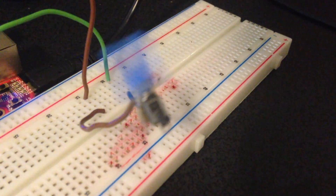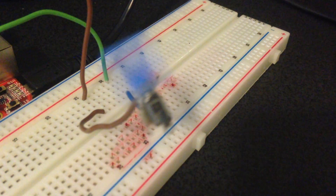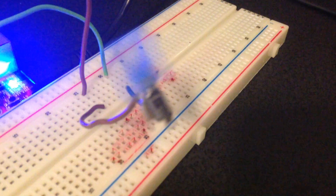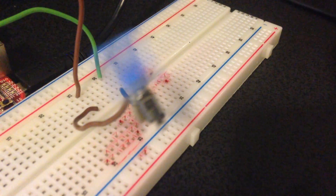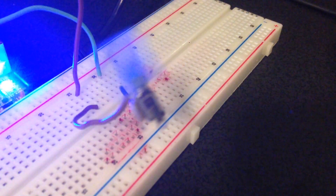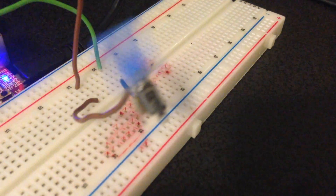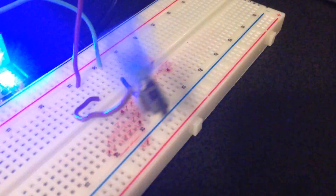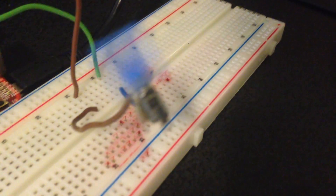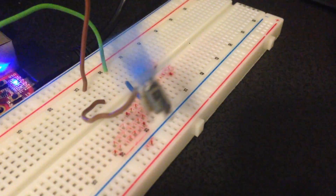So right now I programmed a little program that uses one of the GPIO pins to output a PWM signal — pulse width modulation signal — to run this little rumble motor. The rumble motor is spinning at about 100 times a second. This is a rumble motor from an iPhone 5S — the same iPhone whose shell I used to build a little Arduino Uno Flappy Bird game console, where an ATmega328 microcontroller drove a little SPI TFT screen. It's doing a pretty good job of controlling the little motor, and I think I have a really good idea of what I'm going to use this BeagleBoard for.